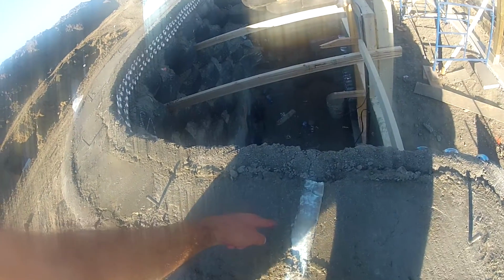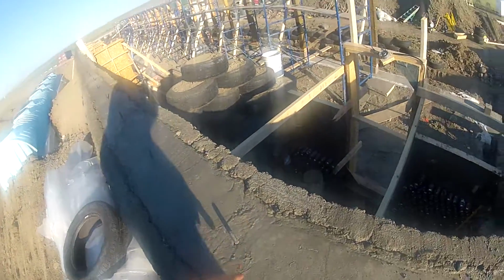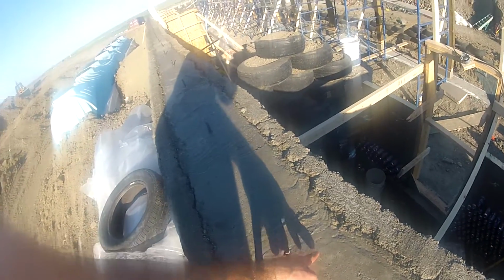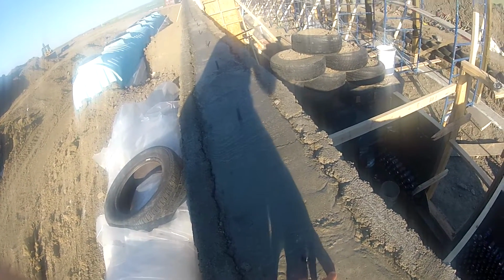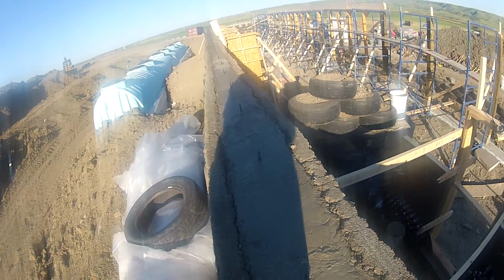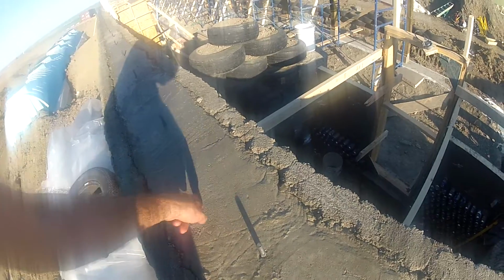We were hammering them like, okay, no, first, sorry. First, we looked at the center of a tire at the end of the wall, center at the other side. From the center we went 5 each side to have a 10 inches wide bond beam. So we put 2 strings to have an idea of where the bond beam would go, and we would plant these pins like we'd stagger them up and down, like inside, outside.